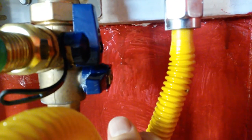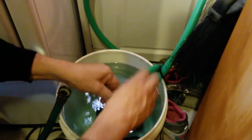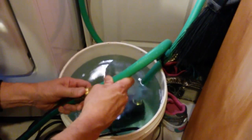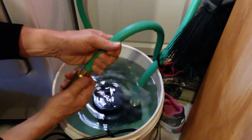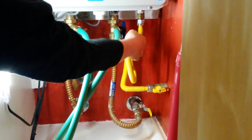Afterwards, we close off the cold water service port, but we leave the hot water side open. We take the discharge hose and attach it to a hose that leads outdoors, so that we can now flush the system using fresh water from the cold water side — going through the tankless unit and out the external hose. Turn on the cold water main; it feeds the tank and flushes out the remains of the vinegar solution. Do this for about 5 or 6 minutes.